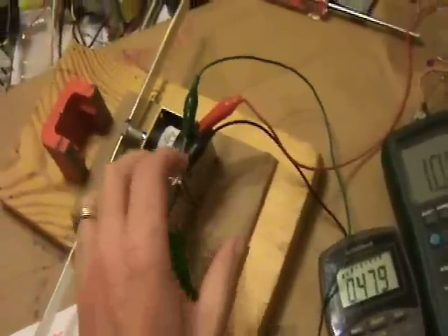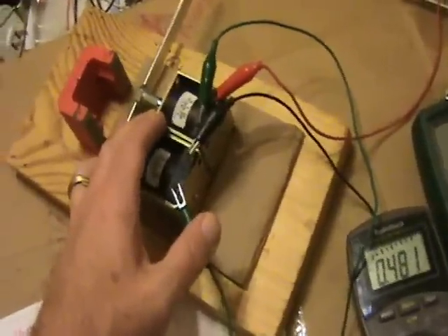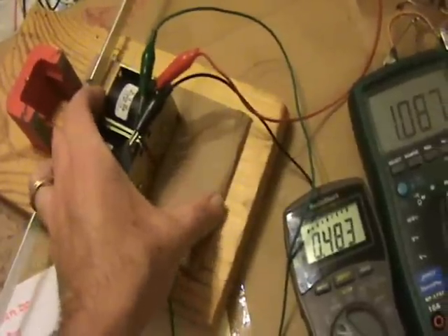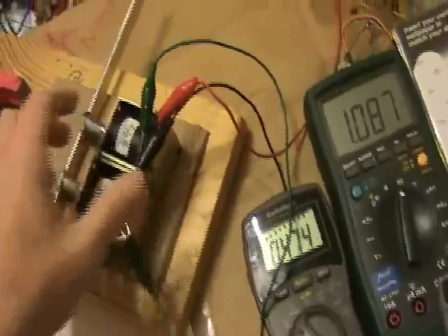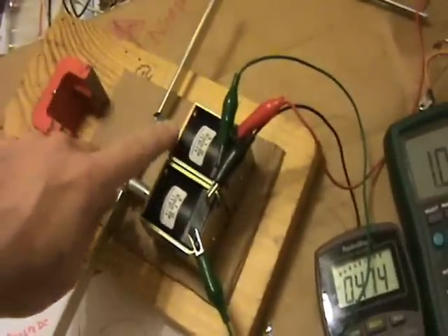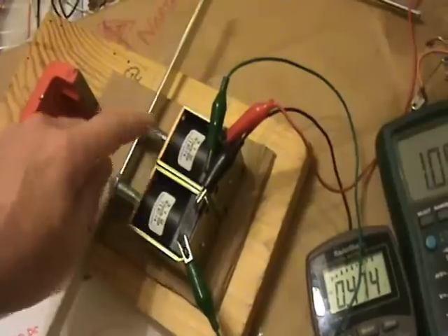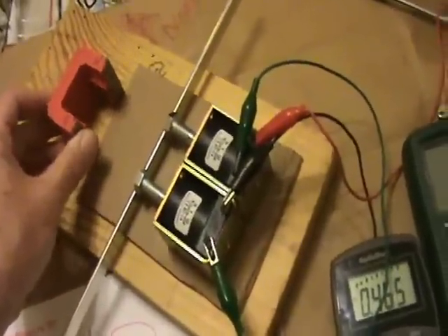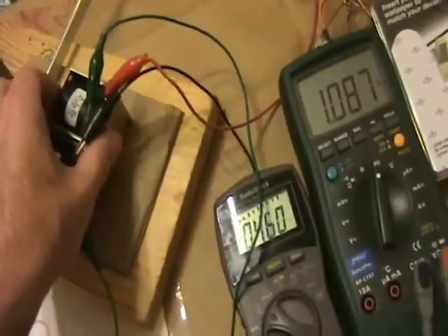This is not held together firmly. If I move it too close, it will snap against the magnet. So let me pull this in the back again, so the current drops. Now, that's with the south pole here, and with the pulse creating a north pole here, a south pole here. So there is a mutual attraction that occurs when this is being pulsed. If I flip the direction of this magnet, and now when I move close, the current drops, because there's a mutual repulsion.